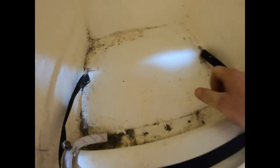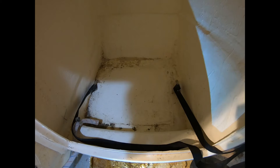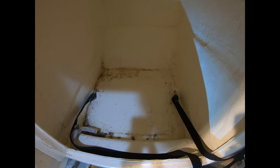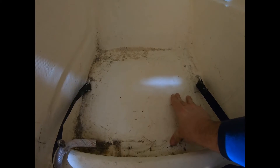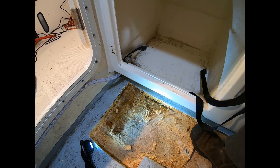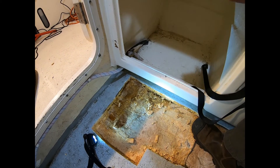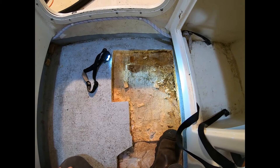This portion right here — I don't know how well you can see it flex — but it's soft right underneath where the tank was. I'm thinking my whole problem came down to three screw holes. I don't believe any of those were bedded; there was just this little plate in there to keep the tank situated. It's soft here but back here it's really firm — tap test it to hear the difference. I think those three screw holes let water penetrate enough that over time a little bit of water got in there, and on flat-bottom dory boats, once that water gets in and the core softens up, the pounding hits really hard right underneath this section.